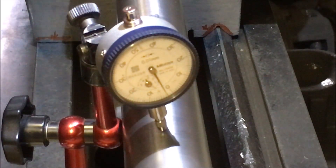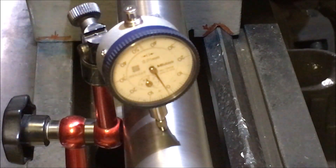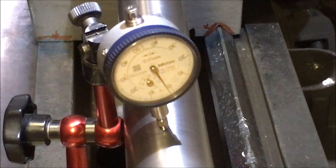That's four and a half plus two, so if we take a midpoint we're a couple of divisions up and we should only be one. One division is four ten-thousandths. I'm not overly fussed about that — it could come down as soon as I start bedding in that bearing.